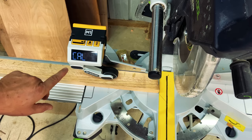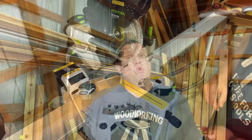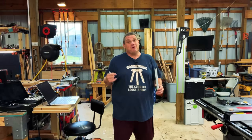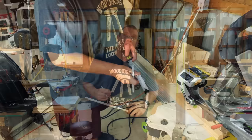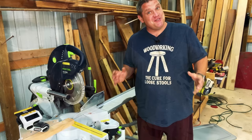To enter calibration mode, make sure the tool is off. Press and hold the left button and the center button, then press the right button one time. This will put you in calibration mode with the M1 reading 'calibration zero.' Push your wood past the saw blade and make a fresh cut on the piece. Once that cut is complete, press the zero button on the left-hand side.